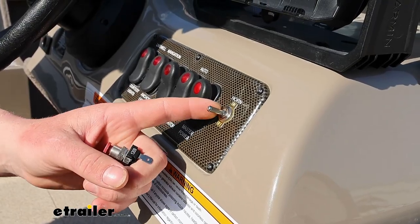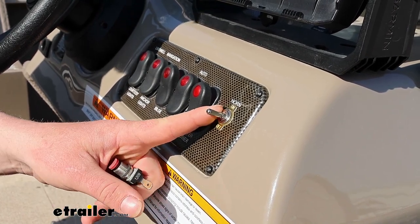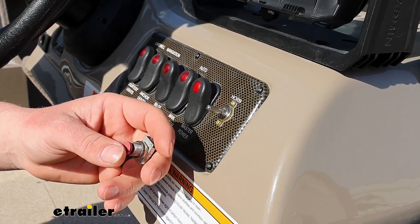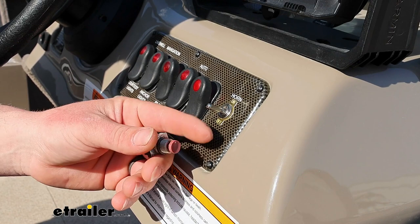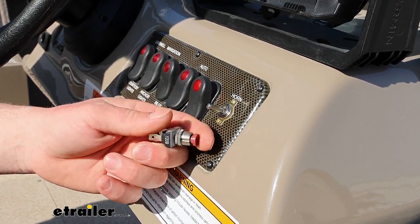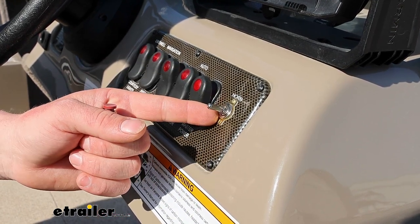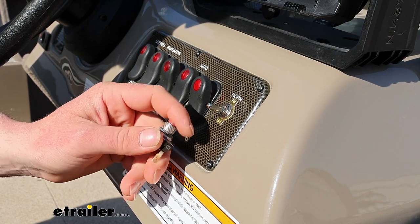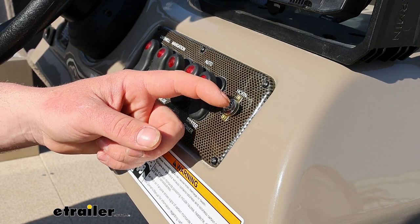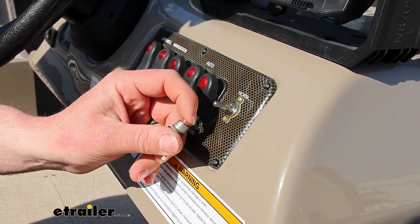I'm using this switch here today on my boat to turn on some lights that I mounted up on the front of it. That way I could see on the river at nighttime, make it a little easier to get on the trailer and whatnot. It was really easy for me because I had existing wiring already set up — it was originally for a horn and a momentary switch. The horn quit working and it's a really expensive part, so that's why I ended up changing out this momentary switch so I could have the lights on and be able to turn them off without having to keep a button pushed down all the time whenever I'm trying to see.